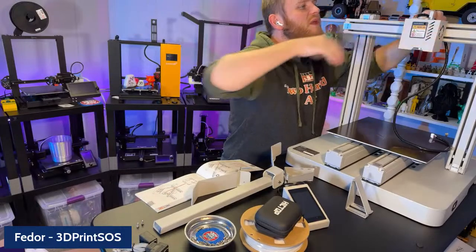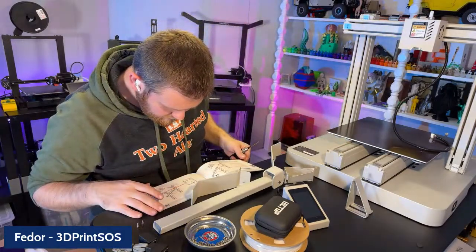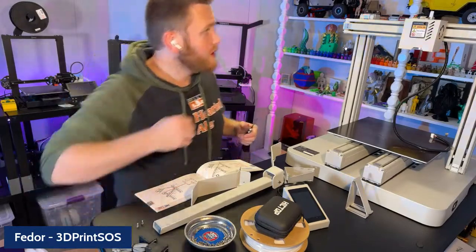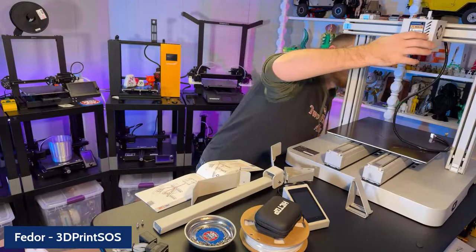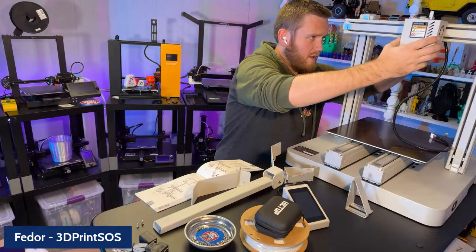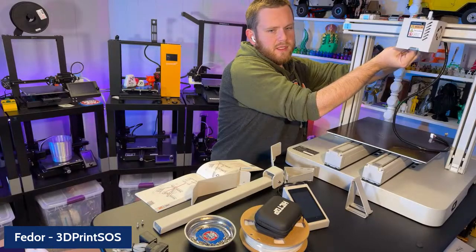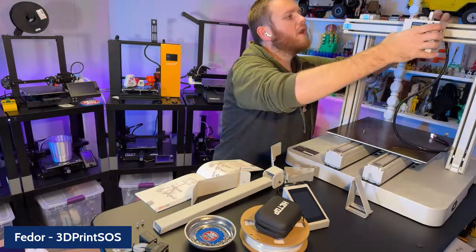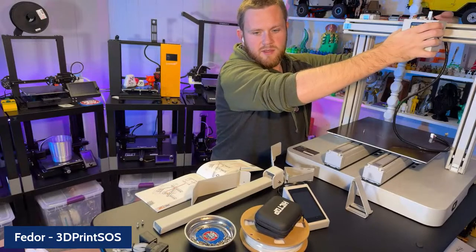All right, something is up here. Let's take a look. Yeah, that's the right holes. M3x8s, there's no other hardware. I've tightened those two and there's still some space. Let me take that apart. Not sure why, but the hardware has a hard stop, but it's not tightened all the way. Almost like this hardware is a little too long. And I know this machine's been assembled before, so it's got to be something I'm doing.